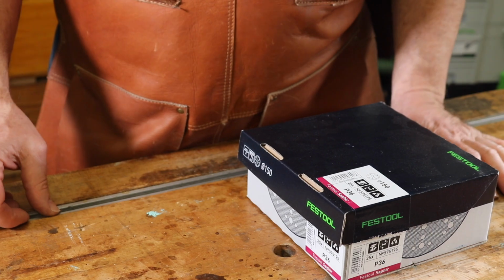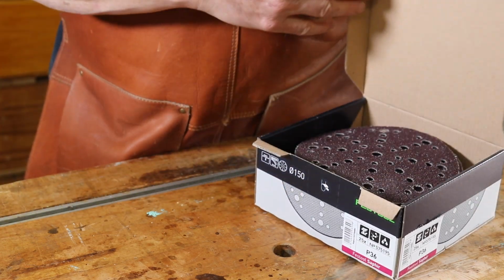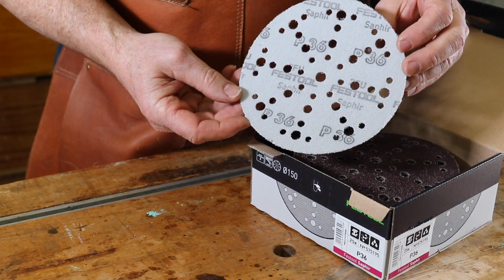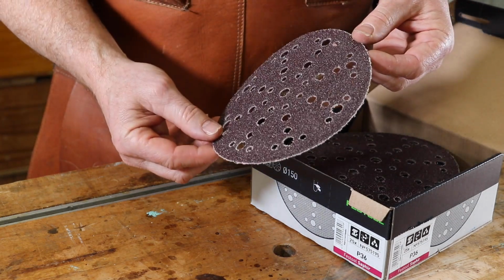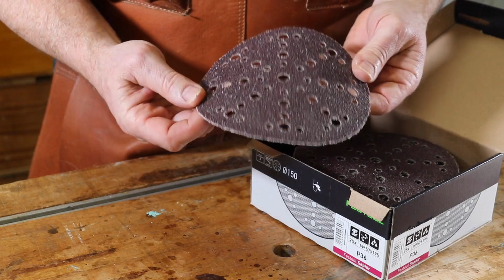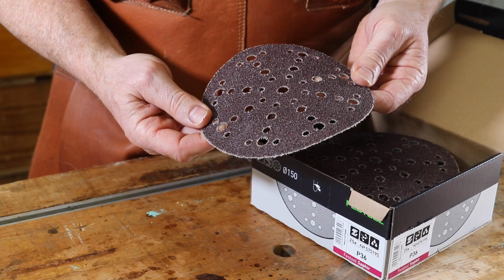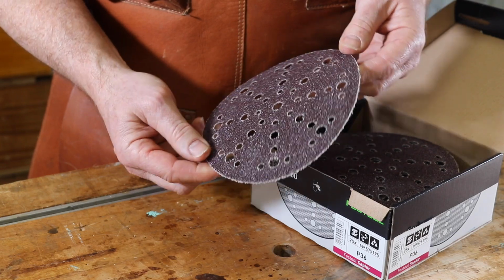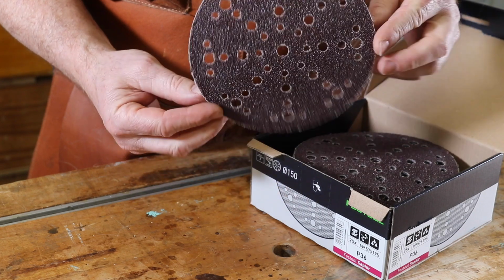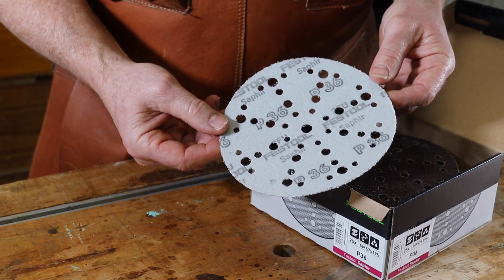Saphir is Festool's toughest paper. Its fabric reinforced backing resists tearing. It's a good choice when you have demanding grinding jobs on wood, paint, plastic, fiberglass, and even concrete or metal. It has an aluminum oxide abrasive with a semi-closed coat and closed bond. Available in coarse grits, Saphir quickly strips away decades of paint and grime from reclaimed timbers. Think Saphir for stripping.